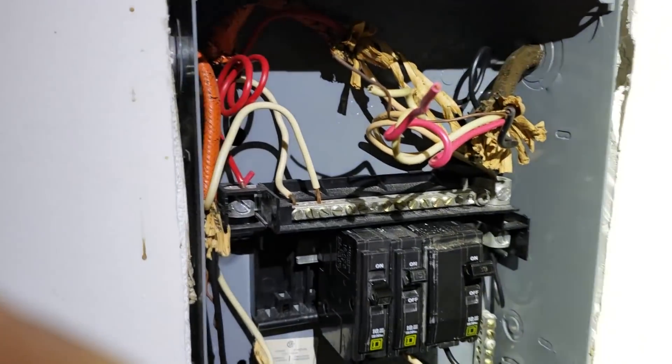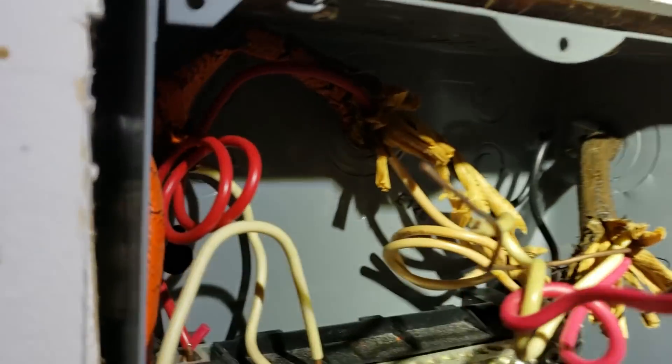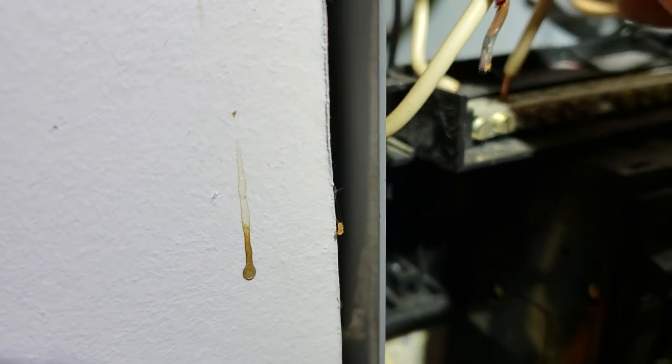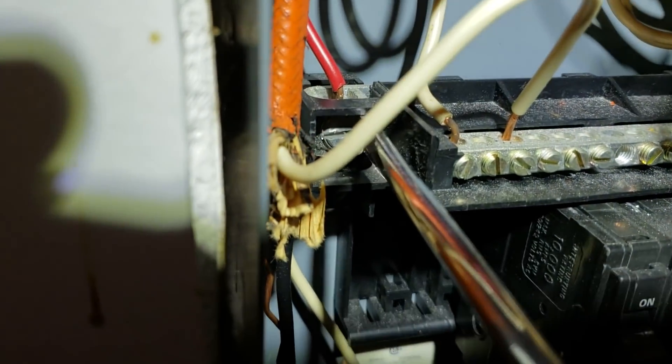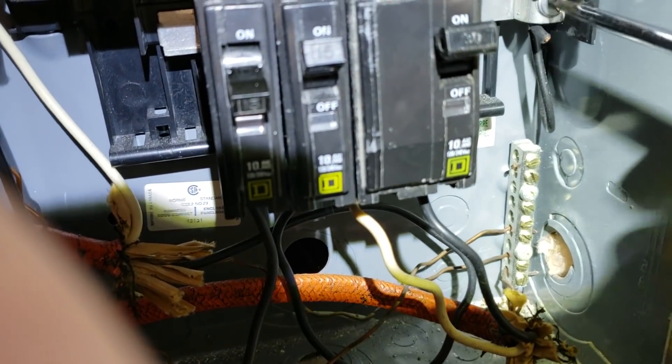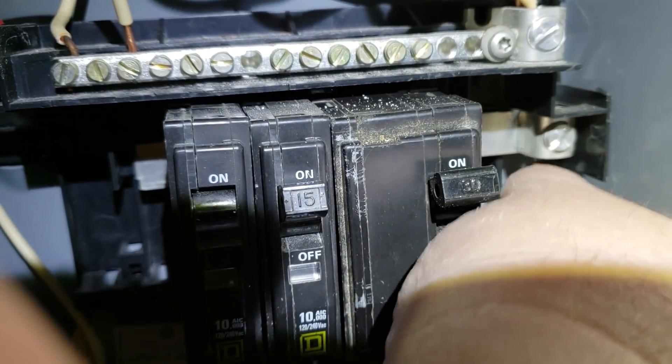Working under flashlight now - I'm going to loosen this off and pull the red wire out. The power is shut off completely to the garage. You can see where it's been pitting right here - it's been arcing and burning. Looks like two wires were put in there at one time. We're going to put the wire back in and torque that down. The other side might have a second wire stuck in there as well, so we'll tighten that down too - same thing over there. I don't know who did that; that was long before I owned this house.